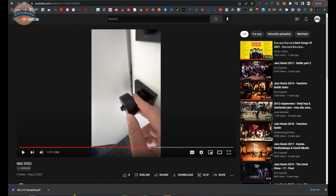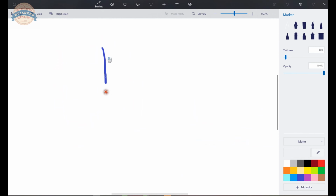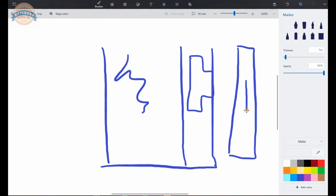When you install a lock set and a strike onto a door and frame, in your application you've got, okay, here's the jamb, this is your soffit, this is the rabbet, your electric strike is in here. Now, in the edge of your door, you want to strike the center line of the latch bolt with the proper relationship of the keeper inside the area where the latch bolt will reside. And there's no doubt that there is something not right about the positioning of that.